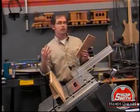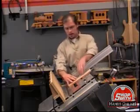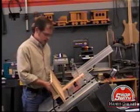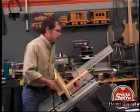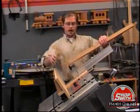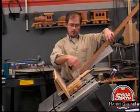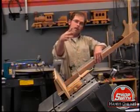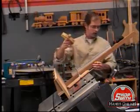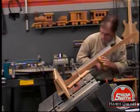Well, three. You can buy your furniture pre-made. But considering the fact that we love to do our woodworking ourselves and all that, let's get this tip here. Basically, what we're going to do is we're going to back it up. See, if you have a board behind the board you're cutting, the blowout won't happen because there's a surface back there. Although you will sacrifice your blowout board, backup board, but that's okay.